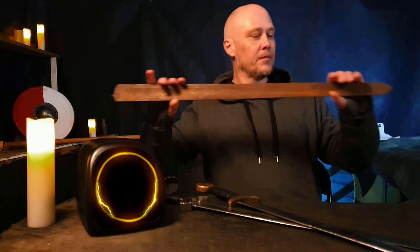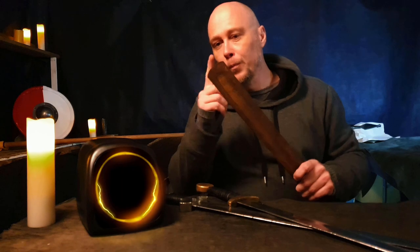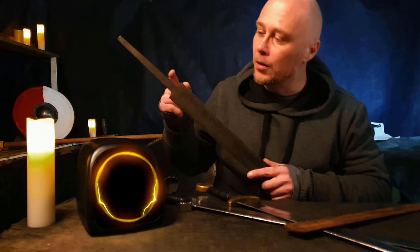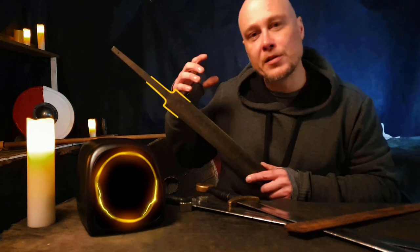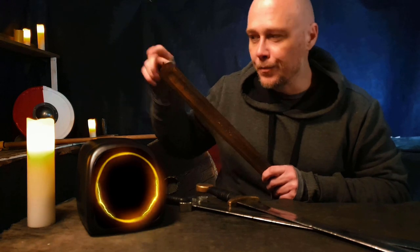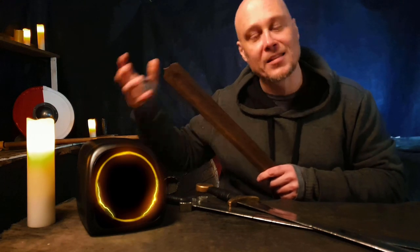Starting with this one — this used to be a sword, a really nice one, but it broke right at the shoulders of the tang. As a lot of you know, the tang is the part of the blade that goes through the handle. On this one, which is made really well, the shoulders of the tang where it meets the blade curve off, meaning any stress isn't hitting a corner. Whereas on this one, you'll see it's a sharp edge — you can see exactly where it's hit a corner, had nowhere to go, and snapped the tang off.